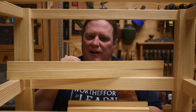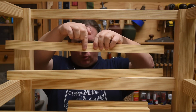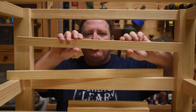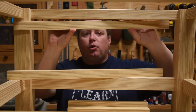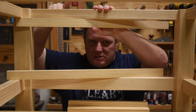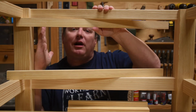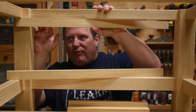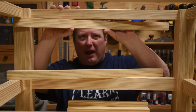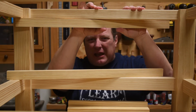So when you are laying out your boards, I would suggest that if you have one that's warped, dipping down in the middle, you orient the board as best you can so that you will be squeezing the edges up to make it flatten out against this top board right here. That way the pieces that come up will be your clamp to get it all flush with the tops. If you were to do it this way, you would have to do these and then get another clamp in the middle to make it tight.